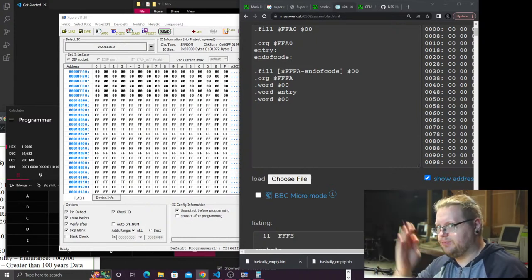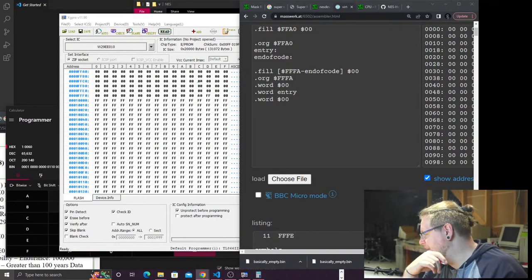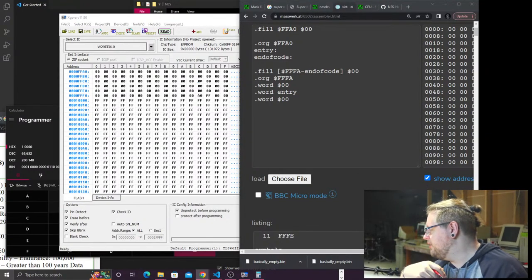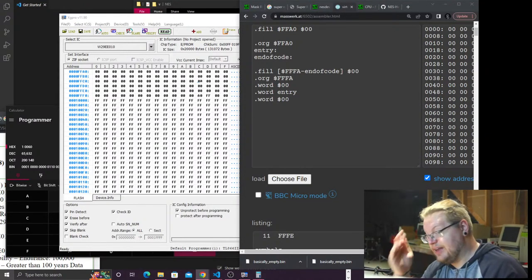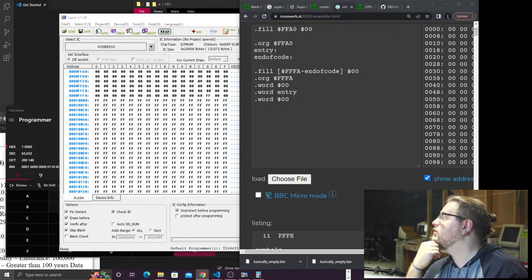the 16th bit. We're reconnected. Where was I in that thing? Anyway, so it doesn't actually sit in front of the, it's not on the address and data bus. It's on them, but it doesn't sit between them. It just reads those lines and asserts a couple of control lines to enable each of the chips. So. Yeah, bank switching glue logic. Exactly.